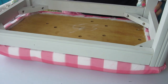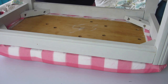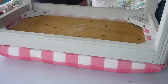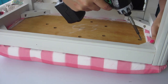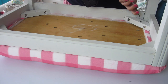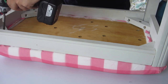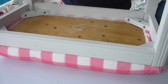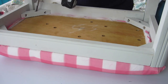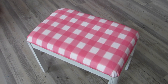Take the legs or base of your bench and put it back on the board. Be really careful to center it and make sure all the edges are covered. Then take your screws and secure the base back to the board — if your screws were stripped when you started, get fresh new screws. Start in one corner and screw in about halfway, then go to the opposite corner and do the same to keep the board from sliding. Finally, attach the remaining screws and tighten everything really well.